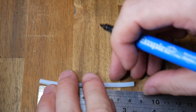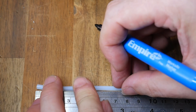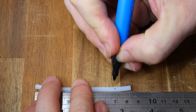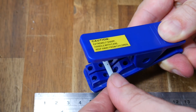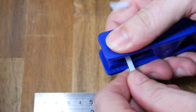The instructions call for us to measure out and mark a specific length of PTFE tube included in the kit. It can be very challenging to get the correct measurement, so I'd recommend adding a couple of millimetres and trimming it down later if needed. It's very important to make a square cut — if you don't have a specialist tool, use a sharp exacto blade and cut carefully.